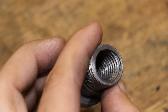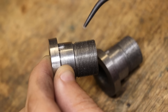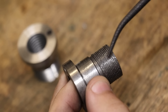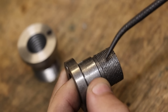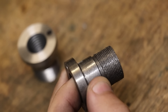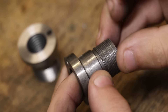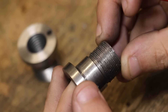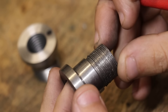It's a very similar story on the outside. This is a 1.25 pitch thread which is okay on the good piece — it could be a little better — but on the other piece there are sections where the thread is just straight up missing. The metal was so brittle it just blew off when I tried to machine it. So even just trying to use this as a bearing material has gone wrong in a few different ways. If you're going to need cast iron, need to machine it, and want to put it under any sort of load — get cast iron that is made for machining.